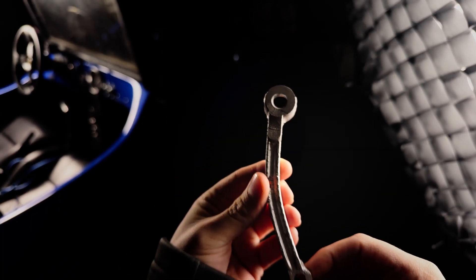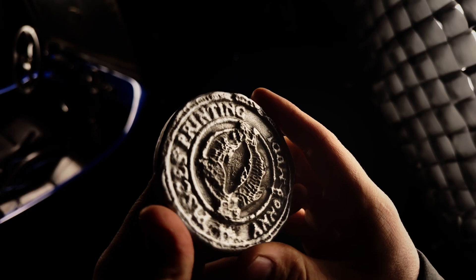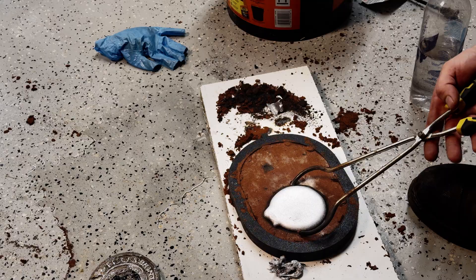Here's where we're at. Project A told me that the two-part mold process has limits right now — it's either the sand blend I'm using, or my current technique, probably a mixture of both. For complex shapes like the speaker basket, I'm going to have to move to a better bonded sand or even a different casting method. Project B proved that even within those limits, I can still pour functional parts if I design for an easier mold, smaller overall, with thicker walls, and a touch of post-processing — and that's honestly a huge win. Project C showed we can pull real detail in aluminum straight out of the sand. We walked away with a clean coin and an actual usable part for my truck. Go ahead and hit subscribe, ring the bell so you don't miss round two, where we come back with smarter molds and hopefully slightly less sketchy molten metal shenanigans.